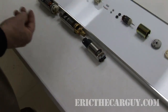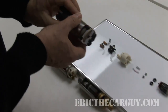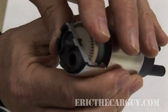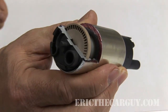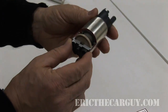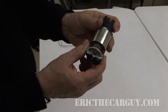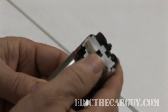At Airtex we primarily use three types of pumping elements. Most automotive applications use what we call a regenerative-style turbine. The rotating member is a one-piece engineering polymer plastic part. Nice thing about turbines — they're nice and quiet. They do have to turn at a higher RPM level to gain the efficiency they need, so they are a little more prone to contamination damage. There are extremely tight clearances between the housing elements and the rotating turbine.